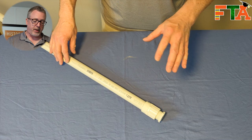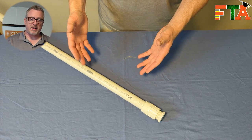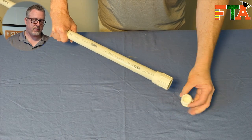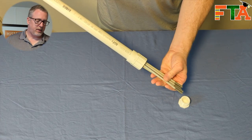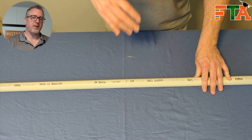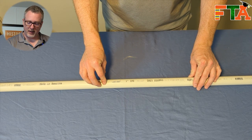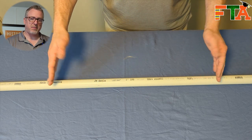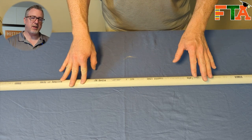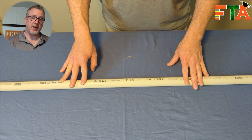The last item is kind of hard to show because it's so long, but I've built another PVC pipe for organizing my push rods, fish sticks — whatever term you like to use for them. These used to get loose in the van and float around. It works just like the drill bit tube with a threaded cap. If you want to make one, buy one inch PVC — you do not want the thinnest type because ladders and other things in your van will crush it; we found that out the hard way. Get the thicker grade. These come in 10-foot lengths, so you need to make this about 6 feet long to accommodate 5-foot fish sticks plus the caps and ends. You really can't make two tubes out of one purchase, but at about $20 worth of parts, your fish sticks are protected and always where you can find them.